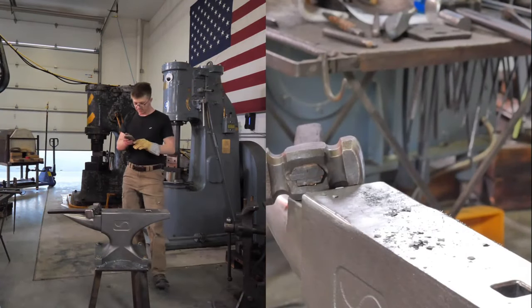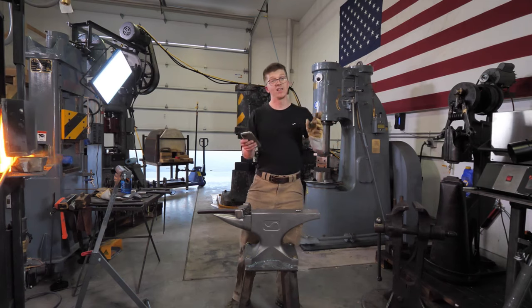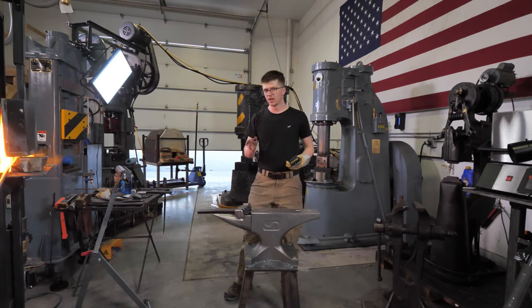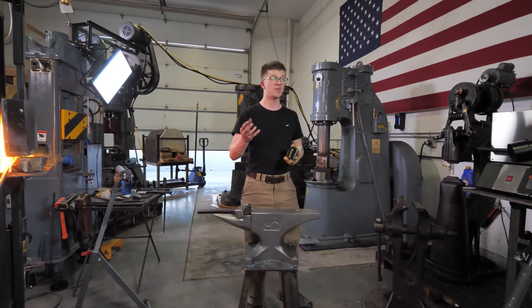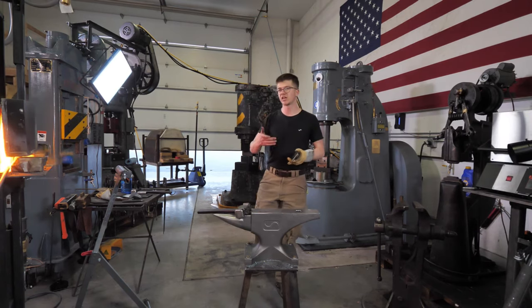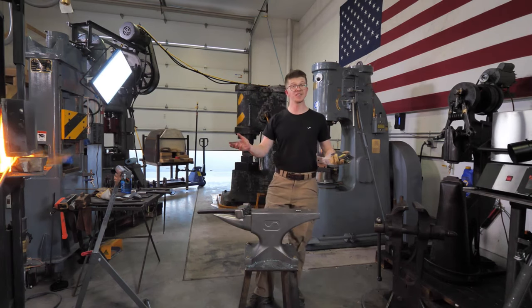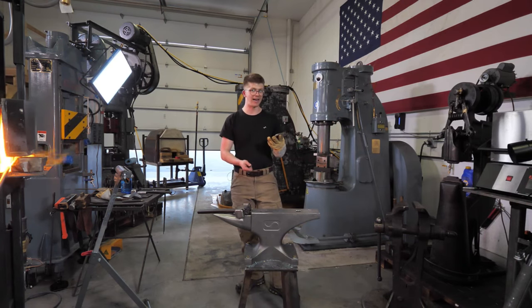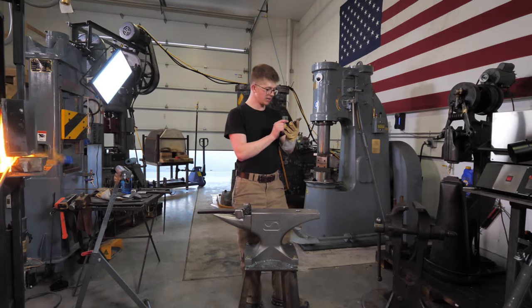Hello from Denver, says C. Simpson, sending us $10. Thank you very much, Mr. Simpson. He is asking, are there any updates on the forge? The Mega Forge. You've got to wait for the video to be fully up to speed, but I'm going to spoil it all now. I got some great advice from a blacksmith named Matthew Harris, who recommended using a bouncy castle blower instead of the blowers that we have, because a bouncy castle blower pushes good volume as well as good pressure. I used to use bouncy castle blowers on coal and coke forges back when I used coal and coke forges. I ordered one on Amazon, $120. We're going to give it a go, see if it works. I just haven't got to it yet. Thank you very much, Mr. Simpson, for the kind gift and the question.